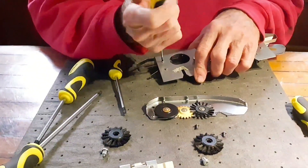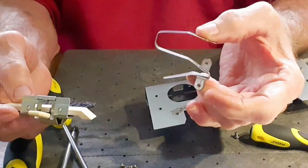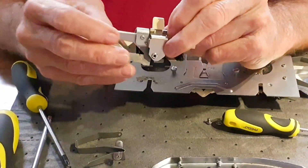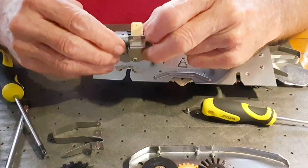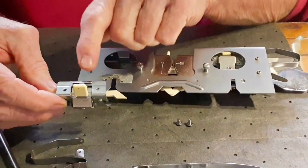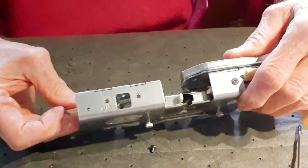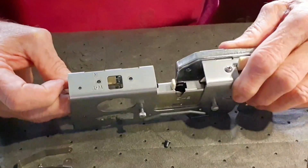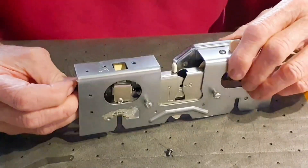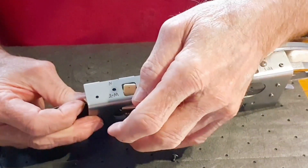This is how the 930 weaving guides come off. Jack wants you to realize they are under pressure — they have to be compressed a little bit to get back in when it comes time to reassemble. I've also loosened the brushes and this guide plate so that they flop around a little bit; that's going to give me a little more maneuverability. What I'm going to try to do is put it in holding it in this direction so that the spring keeps itself in. When going in from the underside, you first have to line up the spring — the brush edge — and the brush goes inside here. Sometimes it'll flop forward and you've got to reach around and move it manually.